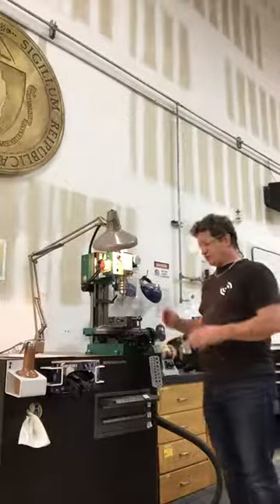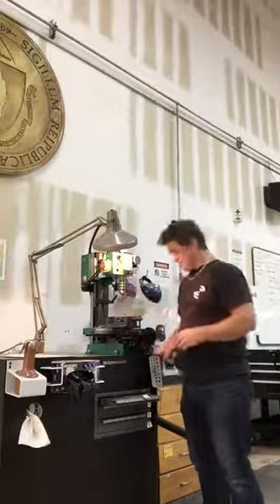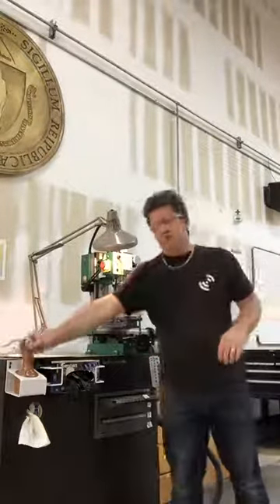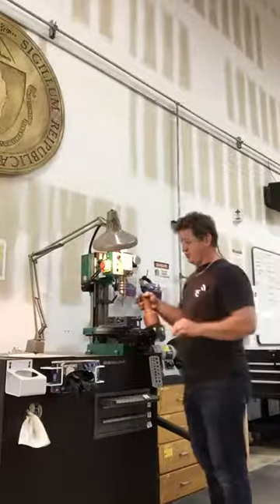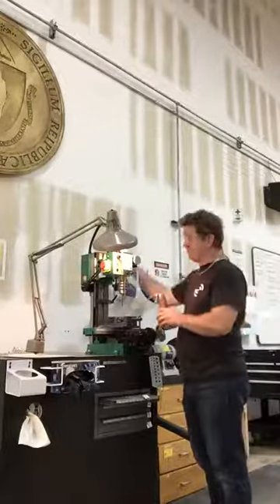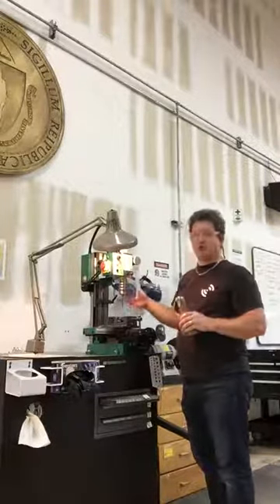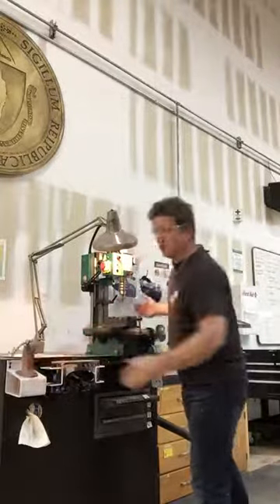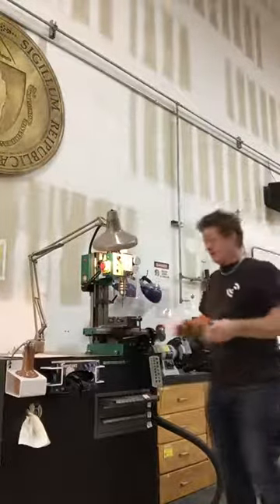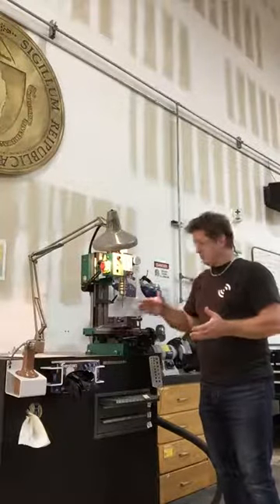Since we're drilling in metal, there's lubrication involved — make sure you lubricate the piece a couple of times before you drill into it. That helps to prolong the life of the drill bit, so a couple of squirts every now and then. It doesn't have to be a lot, and since this is a water-based fluid, make sure you clean off the tool well.